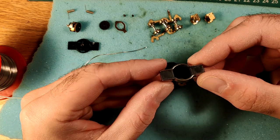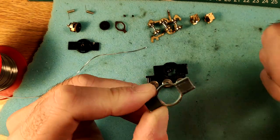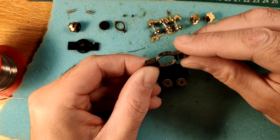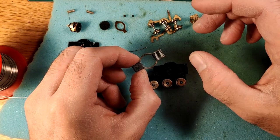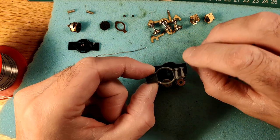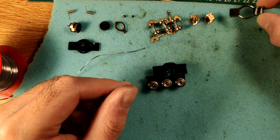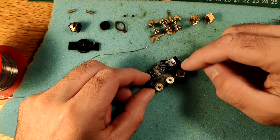Now, I'm looking around this, and I'm not seeing a tremendous amount of oil or anything. But again, oil is very bad for motors, and actually, yeah, I can see some on the magnets. So I'm going to put this to one side, but I won't dunk this in fluid. I will wipe it all clean individually and put it back exactly as I found it, because if you get one of these magnets the wrong way round, it will give you a bad day. So I'm going to put that somewhere extra safe.